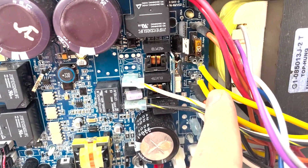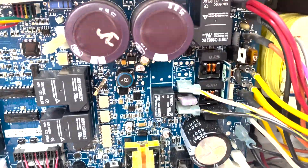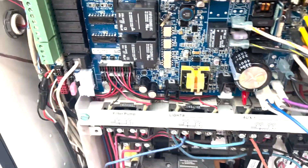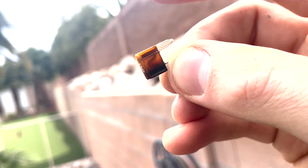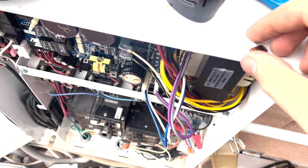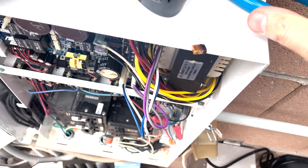Make sure the right yellow wire goes to the right port. I'm going to, real quick, check this fuse. Pull it up to the light and you can see — yep, it's still good. I could also test the resistance on it, but I can get a visual on it. It's not that badly burned, so I'm just going to put that back in.